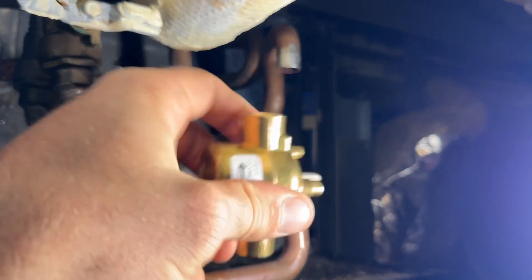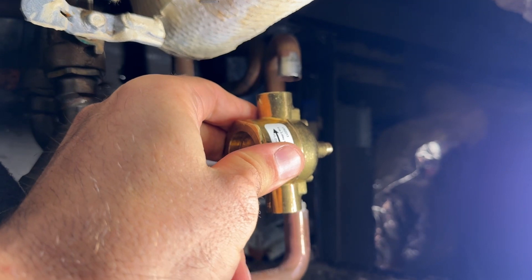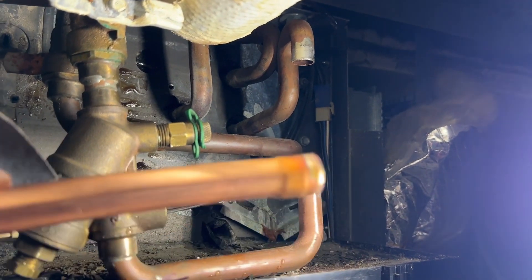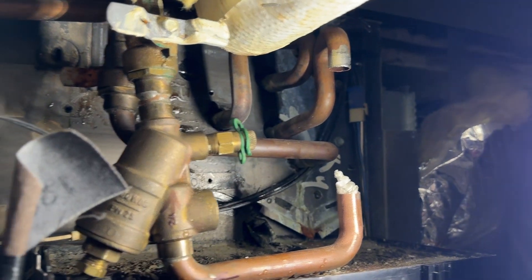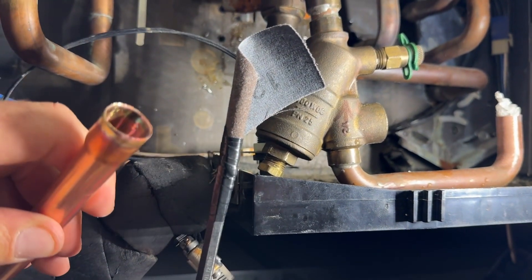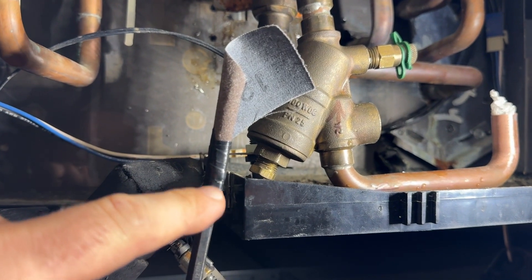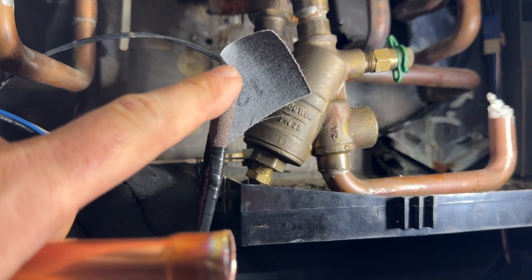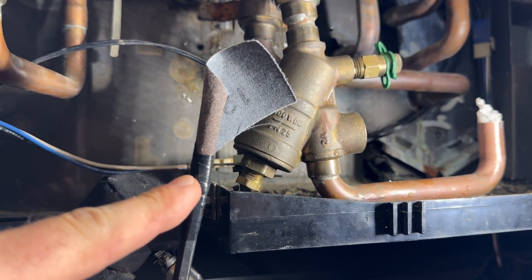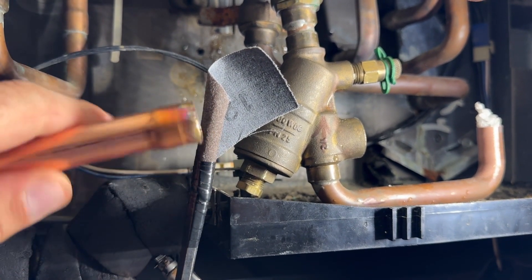The new valve is shorter than the old one, so I'm going to put in a piece that I swaged. I don't have a wire brush to clean the inside of this, so something that works pretty good is if you wrap sand cloth at an angle so that you can tape the top — it works kind of like a flap wheel.